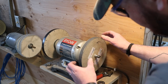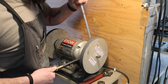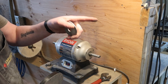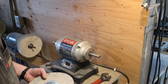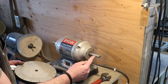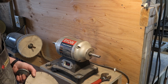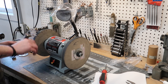Let's take the wheels off the other grinder. Now one thing to note: these wheels are about three-quarters of an inch wide while the new ones are one inch, so I have had to shim them. You've got cup washers on either side — I've shimmed with other hardware to make it fit. That's something to keep in mind if you buy one of these setups: just put your cup on the outside and get a nice fitting shim — a couple of washers, whatever — you just don't want it loose and vibrating.